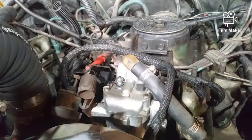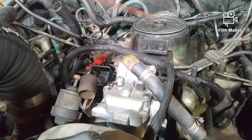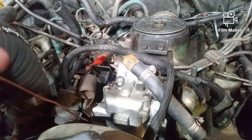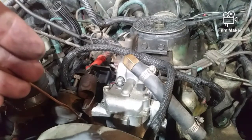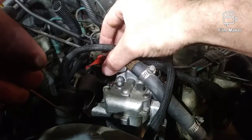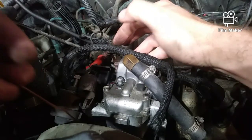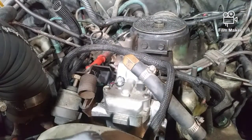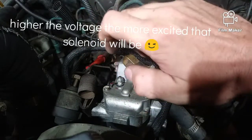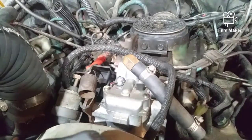What you can do is manually check and listen for click-clicks to make sure your solenoids are working. You can also ohm them out. I'm just using a jumper wire — I'll touch the high RPM solenoid and it should move the linkage. You can see that the bar is not moving. Looks like my solenoid is a little weak; if the engine was running, voltage would be higher and the solenoid would have more power. Probably just needs some WD-40.